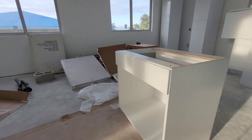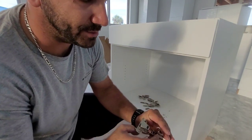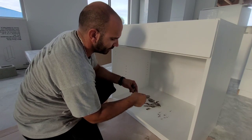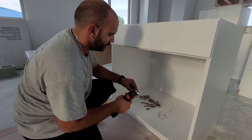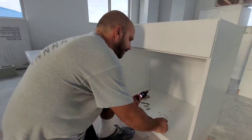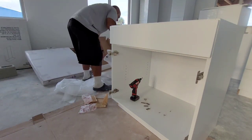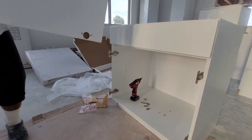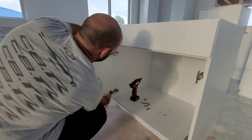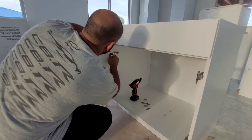Now we'll put the doors on. The instructions call for you to remove this piece from this piece, but I found it easier to assemble the whole thing and then put them on. It's going to use this back slotted hole - that was another thing that took me a bit to figure out. Just put it in the slotted hole, put your drill on it, start the top one. Leave the hinges open, kind of push the door behind it, close the hinges just a little bit and they'll kind of pop on. I like to start the screws to make sure it's in the hole of the plastic and not on the plastic.